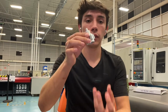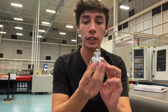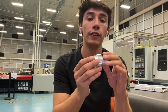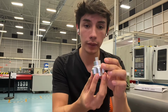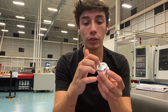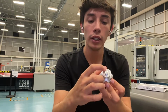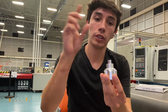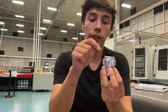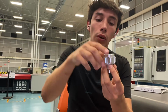Number 1 goes at the base, and it uses turning and milling. The first part uses tools for facing, roughing, grooving, and finishing. The milling part uses 2 different setups. One is used to create the Poka-yoke that goes to the base, and the other to the Poka-yoke that goes to the second piece. We use 2 different assemblies, so the tool reaches all parts of the design.